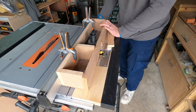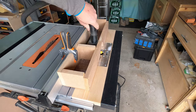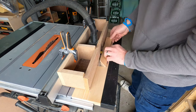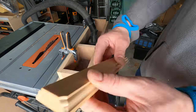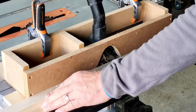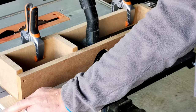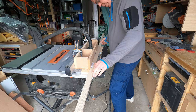The first thing I did was grab a test piece of wood to check the right depth and the right angle for the fence. Having run it through, it was really good — I was very pleased with how it turned out. I needed a little bit of shifting to get it in exactly the right place, but it gave me a really lovely groove. Then I was ready to move on to the longer piece after I remembered to attach the dust collection via my Titan Workshop Vac.